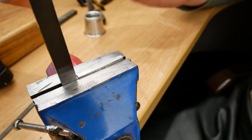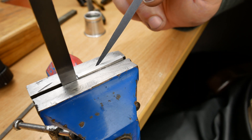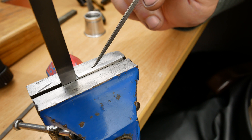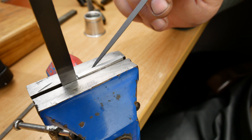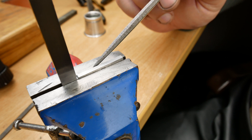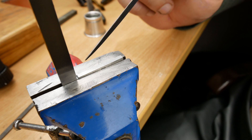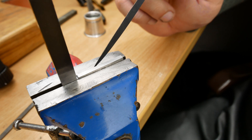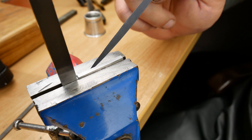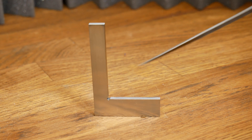Okay, I'm over that now, although I won't be doing it on this bit — no more rotary tool. The coursework suggests what I've done here, which is double-siding a bit of wet and dry onto an old barrette file, and I'm going to be using this to finish up. I'm starting off with a 600 grit and hopefully that should do the trick.